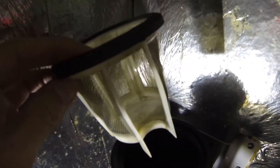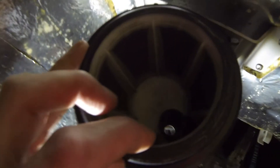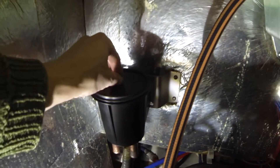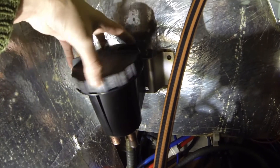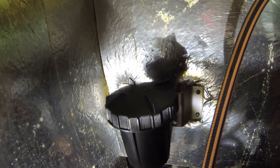When I put in the raw seawater filter element here, you can see there are two grooves and it can slide so you are secured that it is mounted the right way. And then I just put the thing together again — backwards — the plastic covering here. It must also be a bit hand-tight so it doesn't leak.